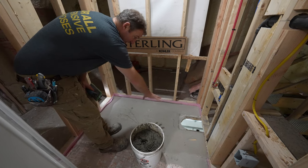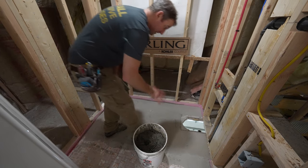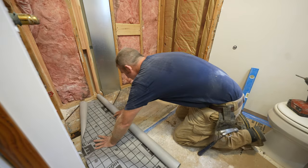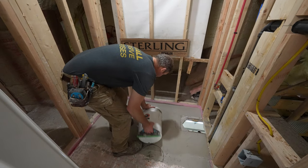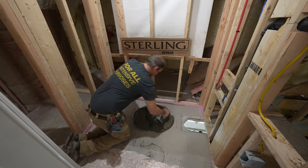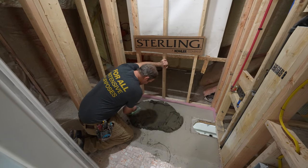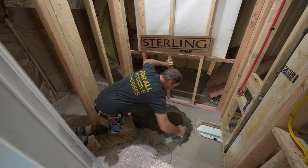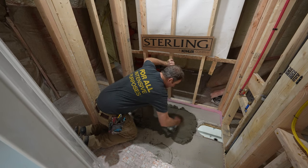We're going to use one bag, primarily because I already have a level subfloor, so I can make this a pretty loose mixture — this is just literally for support. If it was unlevel, you want to make it fairly thick like a brick mortar consistency so that you have the ability to overcome the unlevelness, and you might want to get a second bag. We have floor leveler down so we don't have to be concerned about putting plastic or felt down. We're just going to place this right down the belly of the tub. We're not really trying to level anything out — we're just trying to support the actual tub. About one to two inches all the way along the belly of the tub is sufficient.